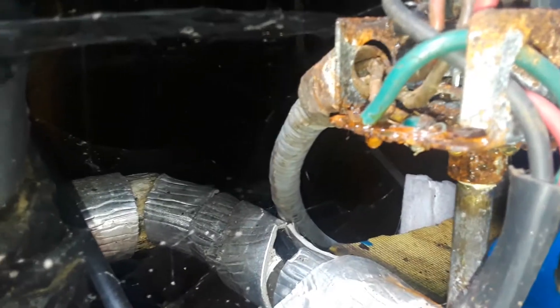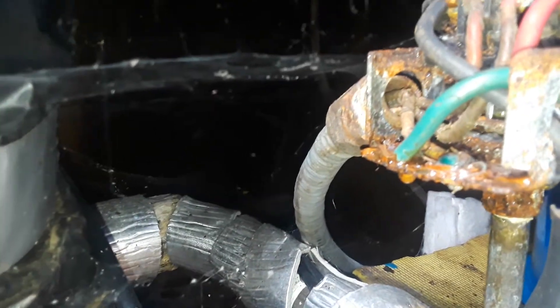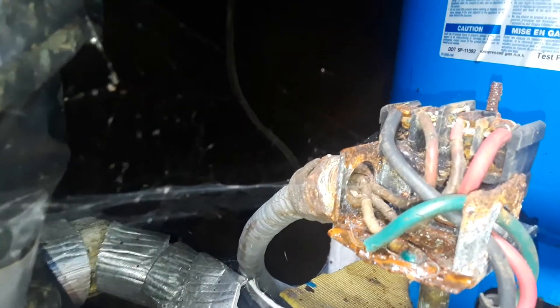This is the top of the motor. It goes down to the weatherproof wiring, and then you have a black, red, and green. The red appears to be going to the far right one — we'll call that number four. The black seems to be going to number one. The other wiring loom that comes from the wall has a red and a red. Both go toward the middle, and then there's a white one that comes out, and that white one looks like it's ground.